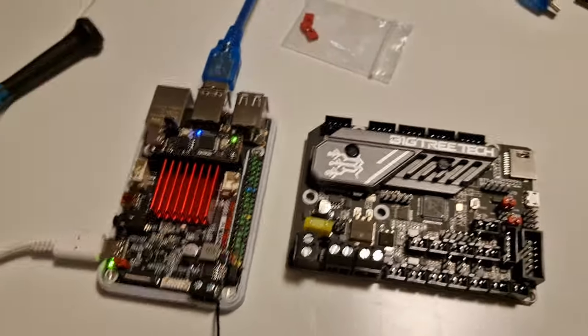As you can see, we're in Mainsail but we do have errors — mainly because nothing is plugged in, so of course it can't see anything. We're going to go over these errors, but before we do that there's another step: we need to make the firmware so that the host computer can talk to the MCU board. Klipper on the host is the program, but it needs Klipper firmware on the MCU to know how to talk to each other.